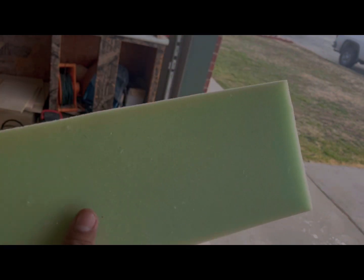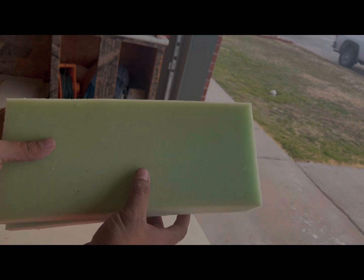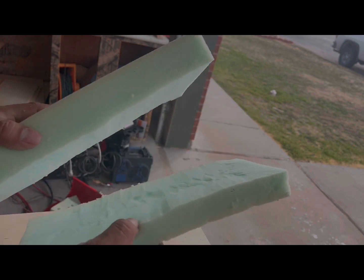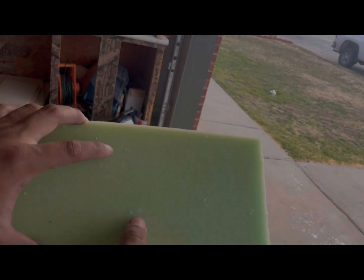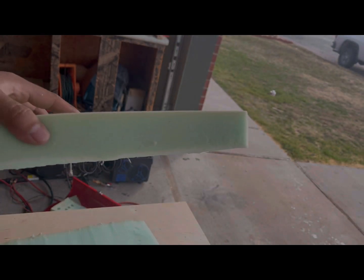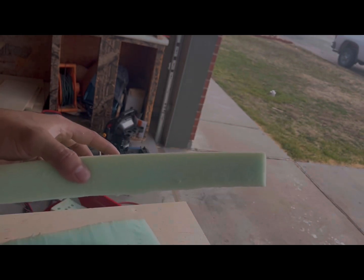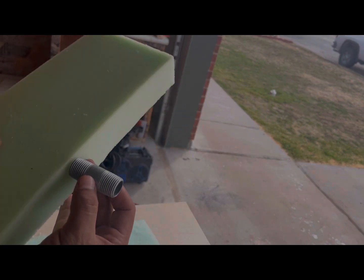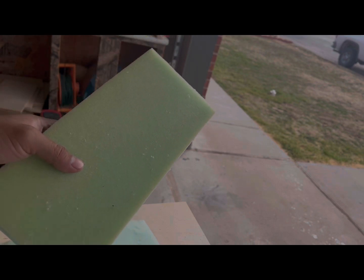Now that I've got everything wired up, I cut a piece of foam — somebody was throwing it away. It's super thick so I cut it in pieces. This is going to be insulation at the bottom of the cell builder so the cells sit on foam rather than directly on the heating pads. The way I cut the holes in the foam is I use a hammer and a half-inch nipple — I literally place it on the foam and hammer it through.